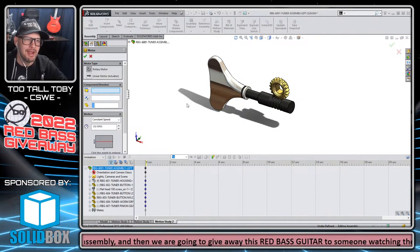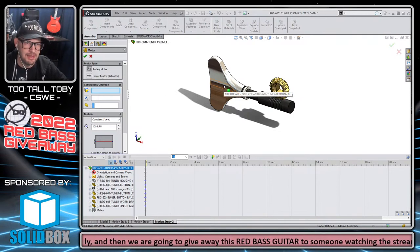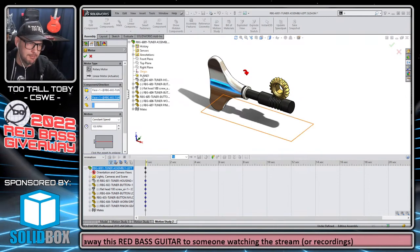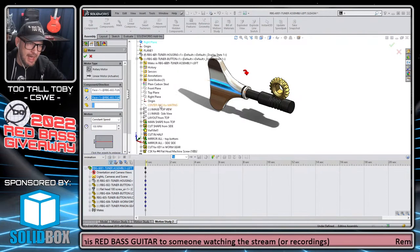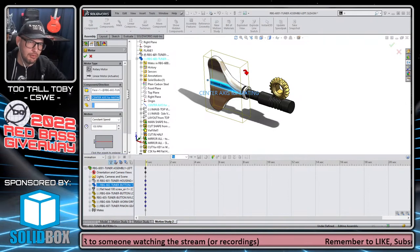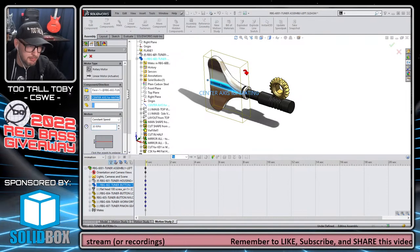Now, the reality is that in the animation that I made, I actually applied it to this face here, and the reason why is because I had the housing shown. If I'm going to apply it to that face, I'm going to rotate it about something, so I need to declare what it's rotating about. I rotated about the axis that we created for mating. So here's the axis that we created for mating, and now this thing is going to rotate. If I want it to go forward or backward, I can change the direction here. And for my speed, I'll say that I want it to spin at 30 rotations per minute.